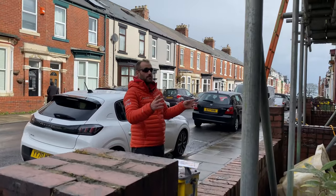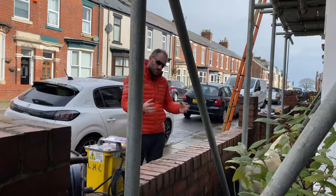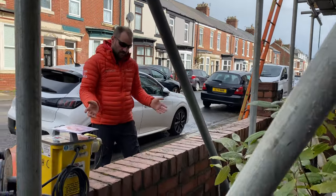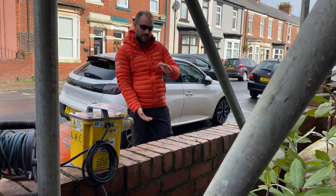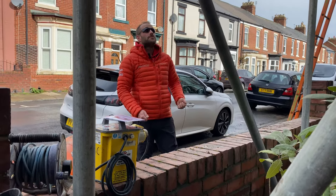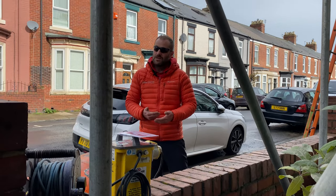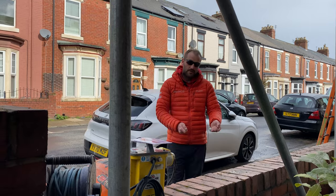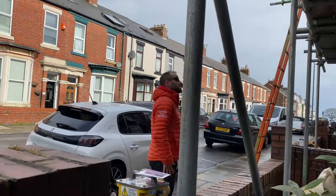If we are pointing with sand and cement using a mortar gun, I would just use a plasterer's whisk in the yellow monkey tub and just mix up a full batch in there. But because lime has to be mixed for at least half an hour, you can't be standing mixing it up. So we've got the mixer, we're going to shove our mix in there.